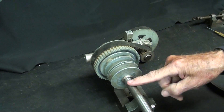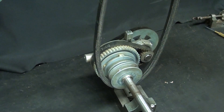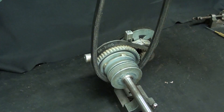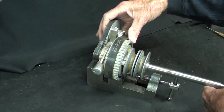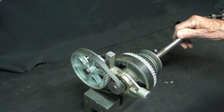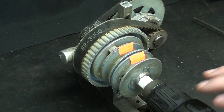The general principle is simply this: let this represent the electric motor shaft turning the reduction device. This belt here would go up to the bandsaw main shaft. If you wanted direct drive for woodworking, it would turn the belt on this pulley; if you wanted to reduce it, you would move the belt over to the other pulley and it would greatly reduce the speed. I'm going to turn this with my electric drill momentarily. I've put orange stickers on these two pulleys so you can see that they are not running the same speed, and this little Delrin reducer I made is on the DeWalt drill.